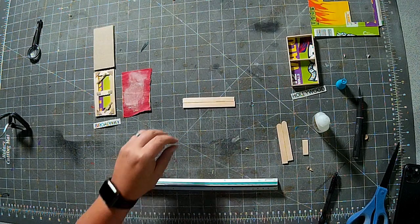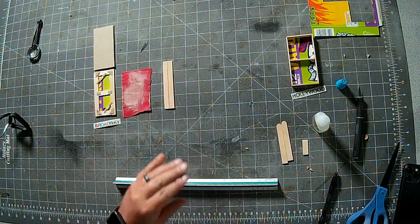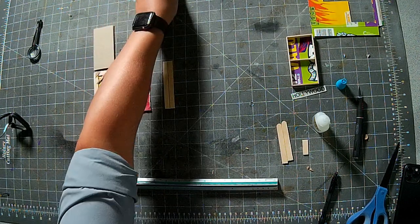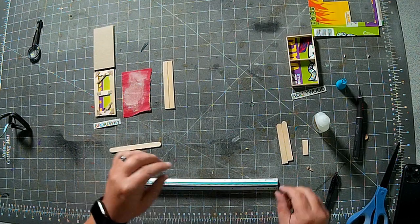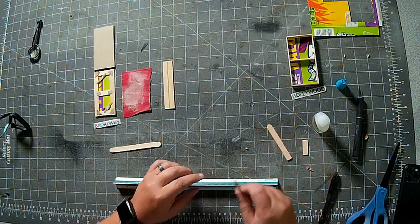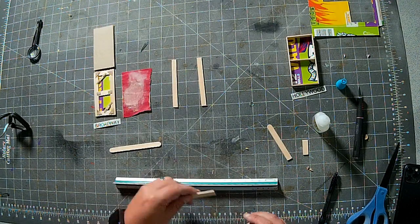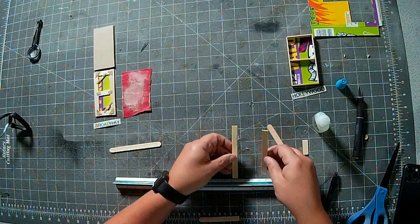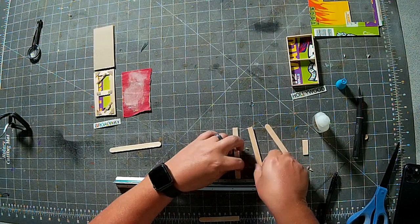The normal dimensional lumber you'll be using for this is a 1x2, which actually measures 3/4 by 1.5 inches. Okay, and then we'll put in, so we have our stiles, now we need our rails. For this piece, they're on edge, so I'm not going to be measuring to get my width like this. I'm going to be doing it on edge.